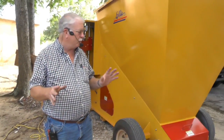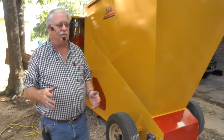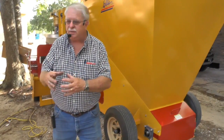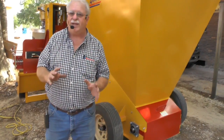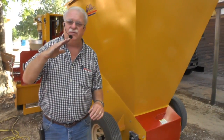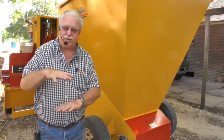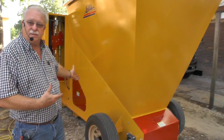Okay, now, one of the things that people will do with a machine like this is they'll overfill the pots. When you first start potting, you're going to have 6 or 8 or 10 pots come through. They're going to have a little bit of soil in it, a little bit more, a little bit more. They're not going to be full till you get your soil flow regulated. You don't just grab it and turn it up to 100%. Just move it up incrementally, maybe 10% at a time, moving your soil flow on your elevator up. Because what you can do is you can overload this thing.